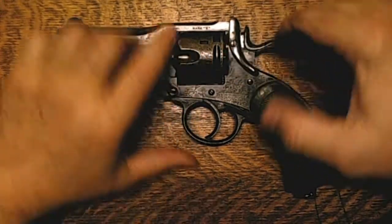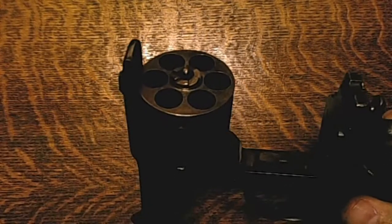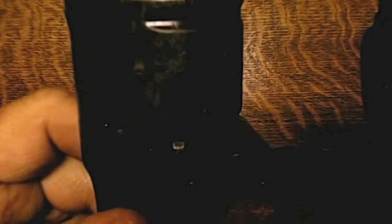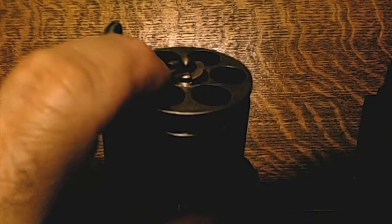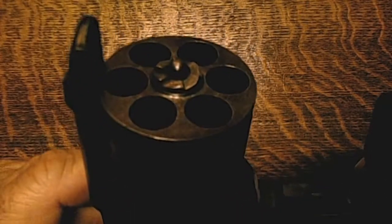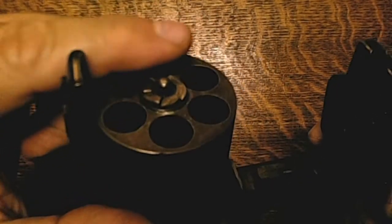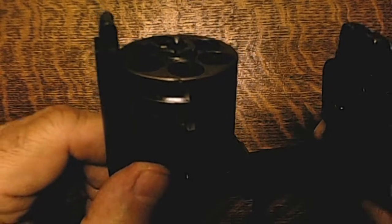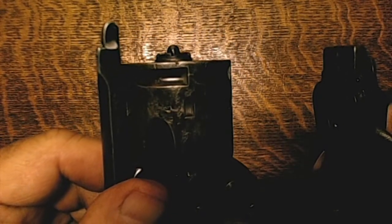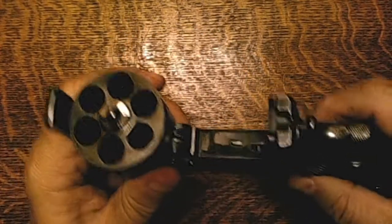The difference is the cylinder is slightly bigger to handle modern nitrocellulose ammunition. If I open it up for you, at the back of the cylinder there's a small lump around the base of where the star is for the extractor. That little lump was created by them turning down the bottom of the cylinder, and the reason they did that was to allow you to use .45 ACP rounds in a moon clip. You can see a little ledge right at the bottom of where the star is.